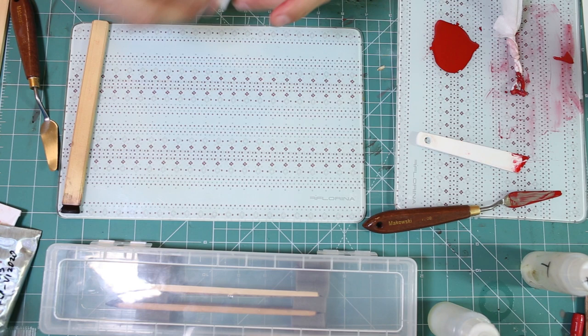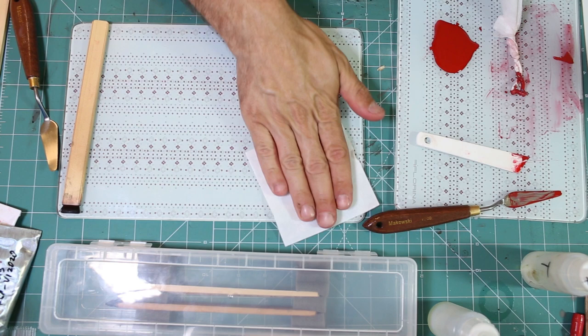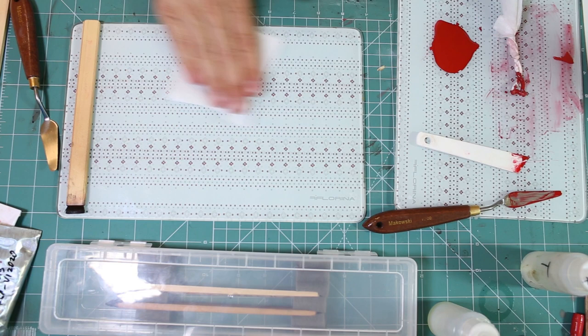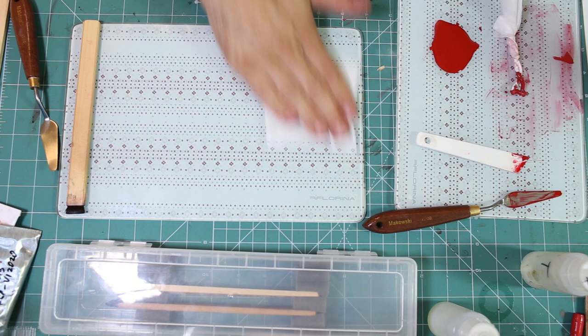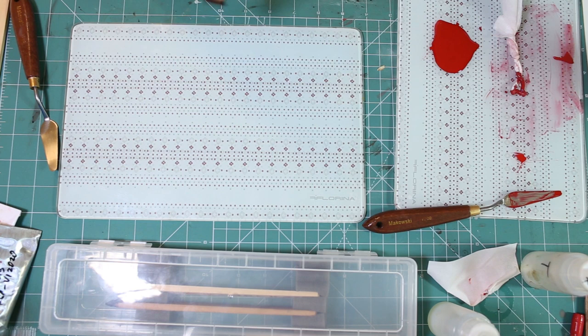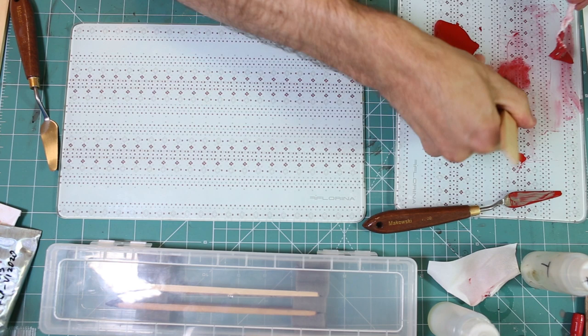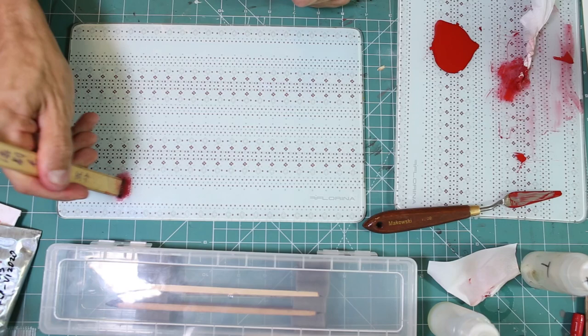What I did a moment before was cleaning the hake from oil — I washed it with turpentine. I worked it on this glass plate, and now I will move to the next step of cleaning the hake before the session, which is cleaning it with Urushi. I'm using a little bit of Urushi from the paper I used to filter it, taking it on the bristles and working it on the working surface.